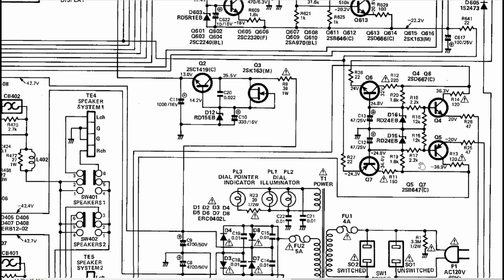The minus 15V leg runs through Q7 and Q5. I checked resistor values and the base-emitter, collector-base, and collector-emitter junctions of those transistors — all good. I pulled Q7 and measured it separately and it tested fine. Diode D15 looked good. But when I measured R11, I got an open — a quarter-watt 150-ohm resistor. I replaced it, also replaced a capacitor I had already removed, fired it up, and everything appeared to be fixed. Replacing that one resistor solved the problem.